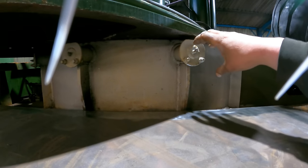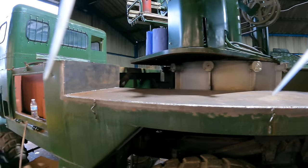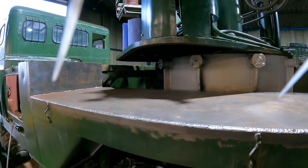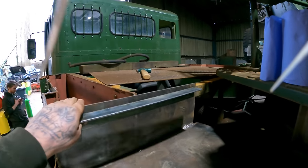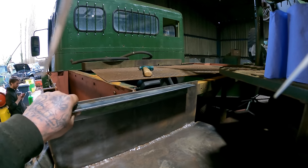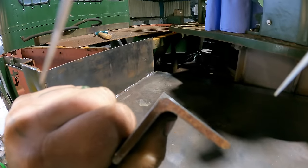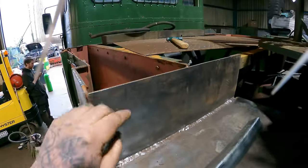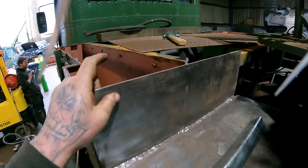Because you pull these plates off, pull out the pin, and take the crane off. So they're important that we keep. That is important that we keep. So we'll lift this up here now and start squaring it up and getting into the right place. We then have this bit of angle that welds on here to give us a lip for the floor. And what I've done to the back of that is I have given us a bevel on that back edge somewhere that we can weld, because once we then grind this flat again, I don't want a lot of heat to put in here.